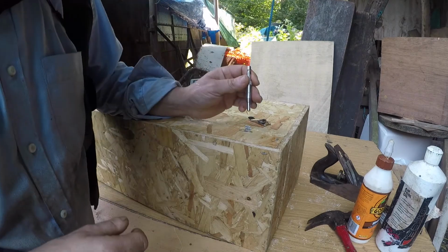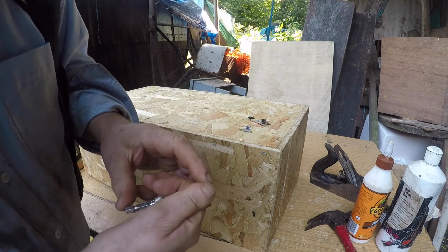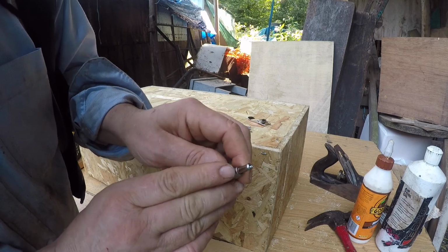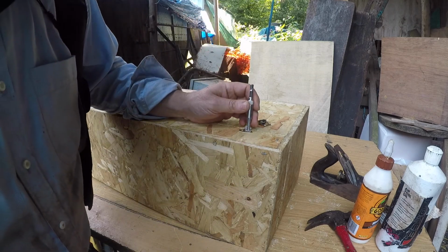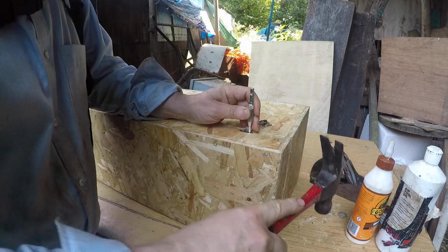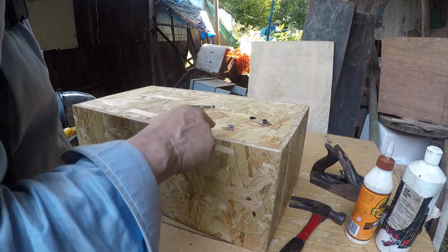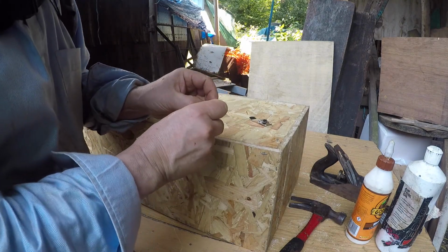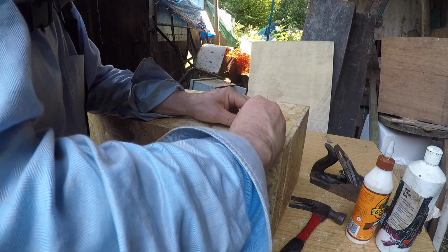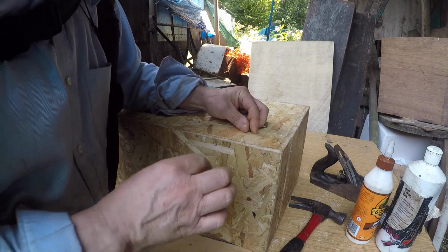For getting the screws into the hinges, I'm going to use a little device designed to be driven by a drill: it centers itself, and as the drill turns, it pushes the screw through. But I learned from Izzy Swan that you can get the same sort of action by just using a hammer, and that provides a point in the center of the hole, which is particularly nice. It's self-centered for you, and generally sufficiently penetrating so that you can get a screw in.